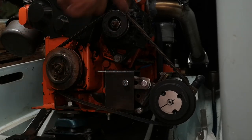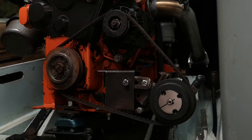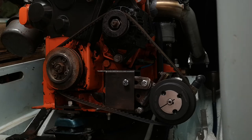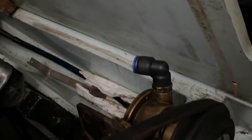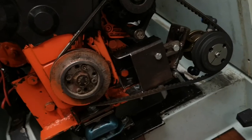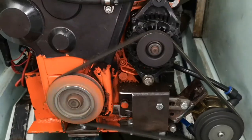I'm pleased with that — I've got lots of options now. By next weekend I shall have a better belt. We can take the old pump off the back, put a blanking plate on, and run this one. Excellent — that's looking pretty good. I just want a coat of paint now, get it all set up, tighten this pulley up. The pipes are all plug and play — this is the raw water pump here, there's an adjustable elbow on it and a push fit, so the pipe just plugs right in. If we want to, we can unplug the pipes off the old one and plug straight into here — in and out. That's made quite a reasonable job, I'm really pleased with it. Lucky it all fitted just first go — seemingly!